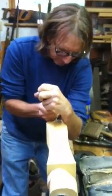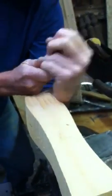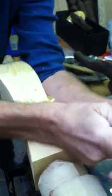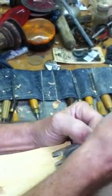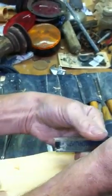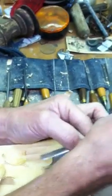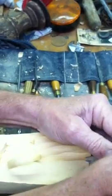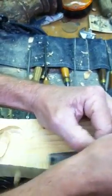When I'm teaching carving, we teach people never to carve towards yourself, but any professional carver you watch spends 90% of their time carving towards themselves — and it's actually the safest way. The trick is that when your tools are razor sharp, you want to make it so you've got a limited movement, like no matter what happens, this tool can't get me. Anchor your elbow or something like that, and you can get an incredible amount of thrust behind your hand, as long as it can't skate loose if it breaks through the wood.